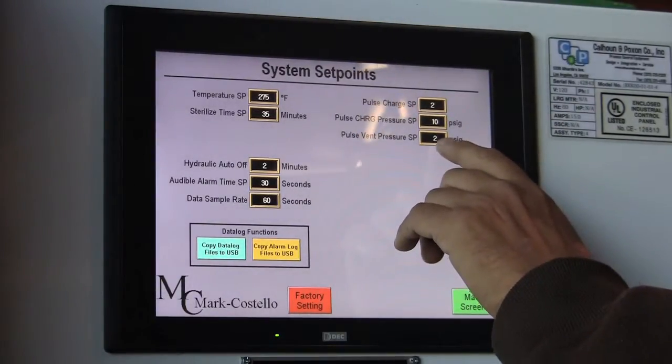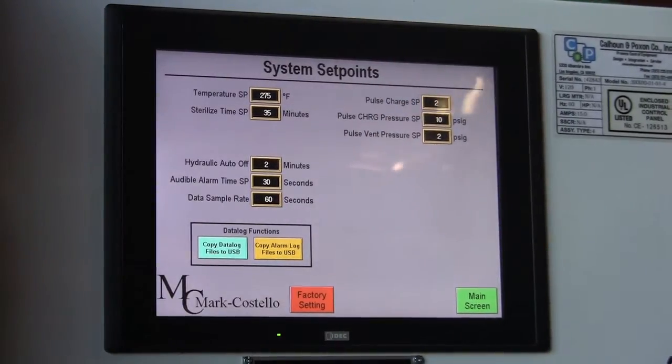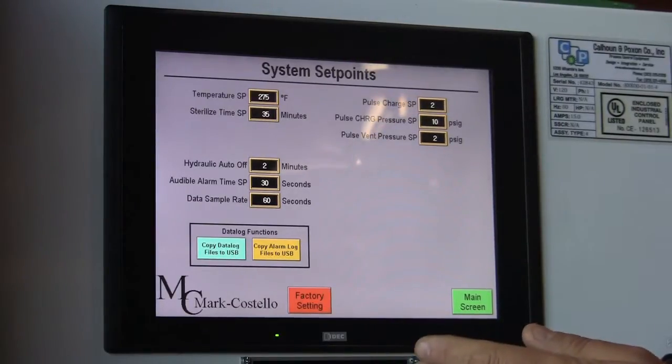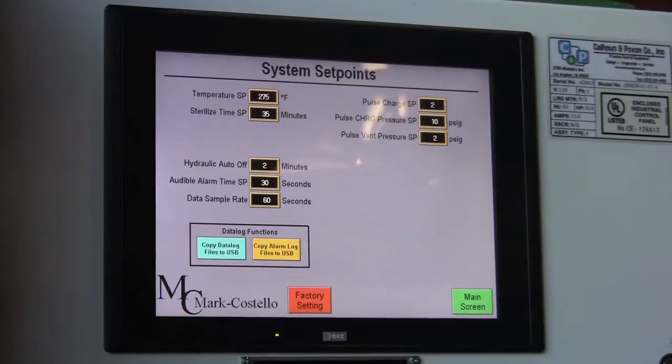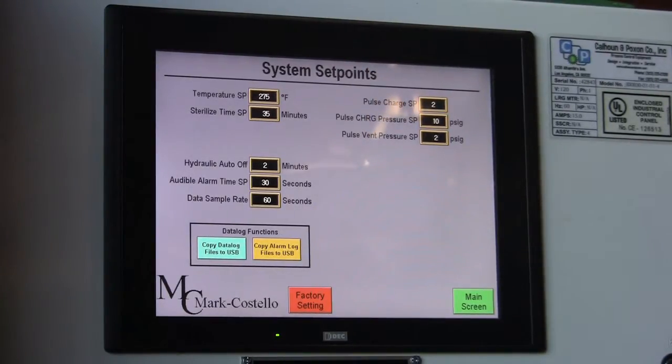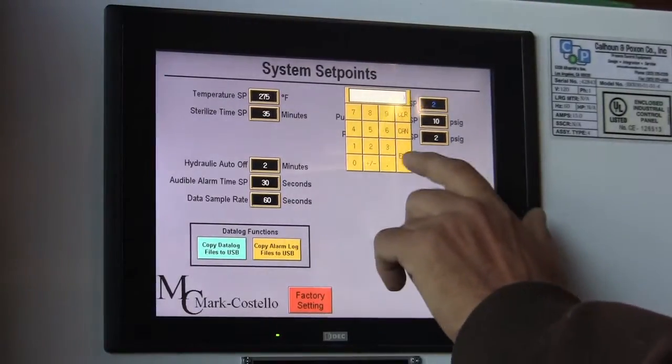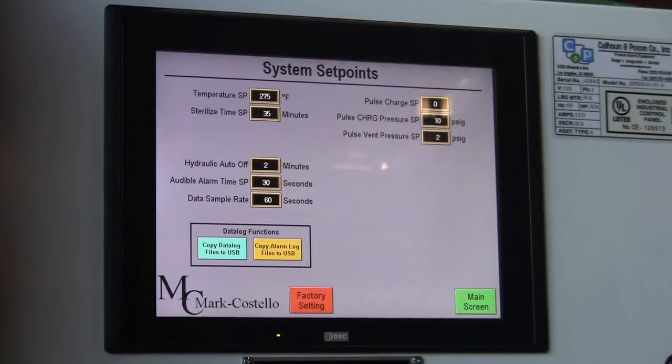When the pressure is evacuated or comes down from that, it will go down to 2 PSI, which it's currently set at. So what that means is when you turn the key, the sterilizer will come up to 10 pounds of pressure, then it will open up the valve, allow the pressure to be relieved, thus preheating the inside of the vessel and the load. You can get a better cook this way depending on resources available to your vessel, such as boiler, water, and so on. This is a good option to have. You don't have to use it — you can set it at zero and not use any pulses — but the option is there, and it is simple to use.